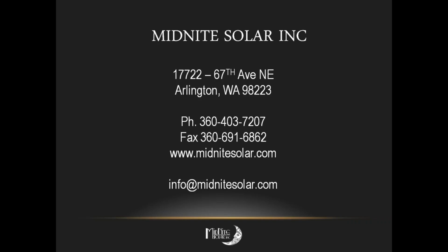Next one, I have a customer who picked up a reconditioned forklift battery and had no data on amp hours. Can the Classic figure out the amp hours? No, not really. It's going to be a matter of observing it and experimenting. You could pick a number, and if it's being very optimistic on state of charge versus battery voltage, then you've overestimated, and if it's being pessimistic, you've underestimated. So you could narrow in on it eventually, but it's going to require input from a human being. The other thing I might suggest is to register on our forum and post a few pictures, and chances are somebody else has seen that same battery and can give you some input on it.